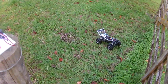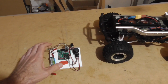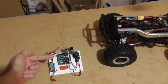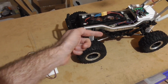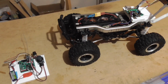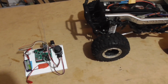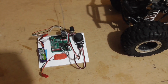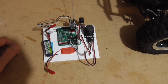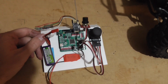Hello, I've just been doing some testing of this Follow Me thingy, which is where you have a GPS on the radio controller and a GPS on the car, and we're using an NRF24 module to send the GPS location of this to the car, and then the car will head towards wherever this is. So I did this a few years ago when I lived in Japan, but I was using plain old Arduino for that time. But what I'm doing here is implementing the same thing using the S-Bus mixer just to sort of test and see how everything's going to work and test the new nodes that I've been making and stuff.